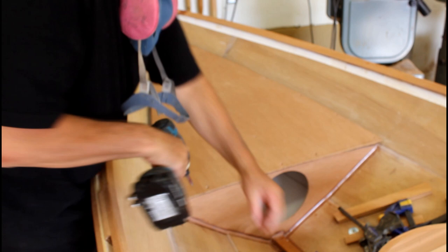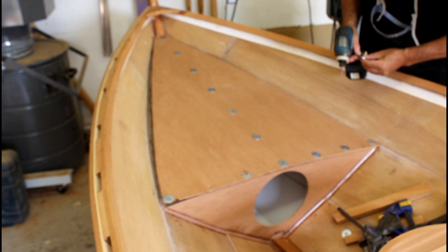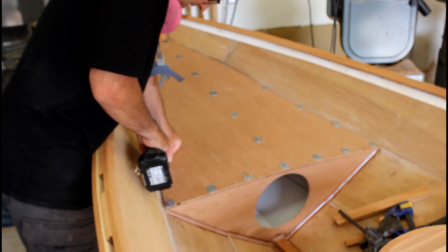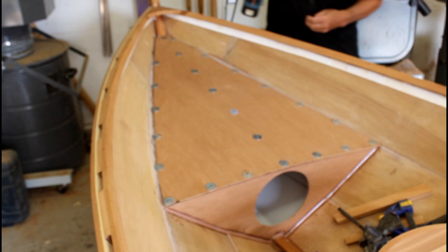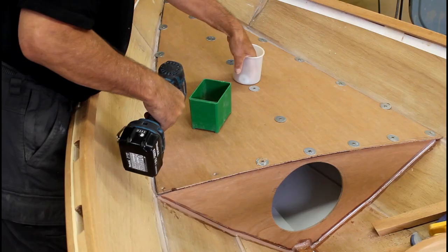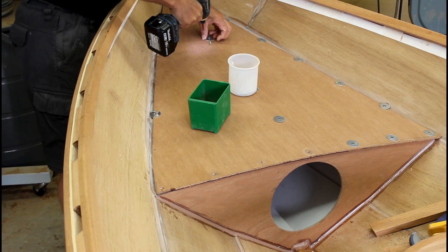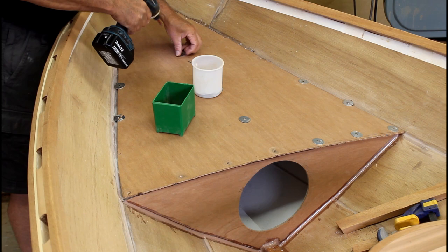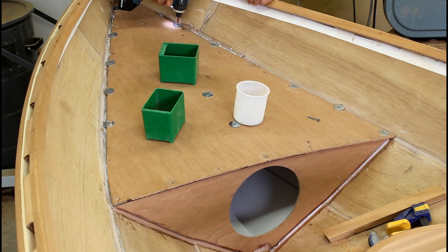To make sure I didn't blow screws right through, I actually switched to a number eight with a washer. I did spray all of the screws with WD-40 a couple of times just to make sure that none of these steel screws — which tend to be kind of brittle — do not snap off when I try to remove them. I went around and hand tightened them all; I didn't want to use the impact driver and go too far. The following day I was able to remove all the screws and washers, but I found the forward section of each compartment had lifted a little bit — I either didn't get enough epoxy in there or there's just not enough purchase area. So I injected a whole bunch more, screwed them down again, and used all the squeeze-out to fill the gap.